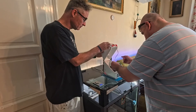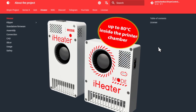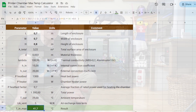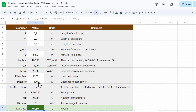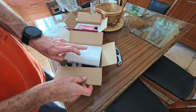As we were testing the iDryer, I noticed that Ruslan, its creator, also offered chamber heating solutions, something our enclosed Maxi very much needed. He was actually very kind to send us two kits to test — yes, two. According to the calculator on his website, a single 200 watt heater would only get this chamber to about 40°C. For such a massive enclosed volume — and mine is even extended upwards with a riser — we'll need two heaters working in tandem to reach our target of 60°C and over. The iHeater kits, all components but not the 3D printable parts, are shipped from China and arrived incredibly quickly, in about a week.